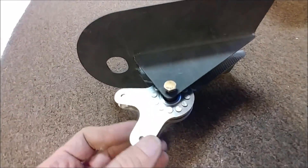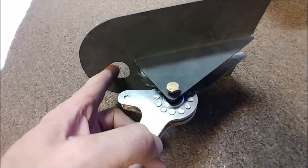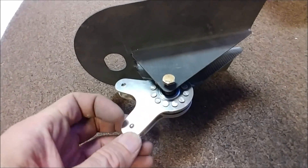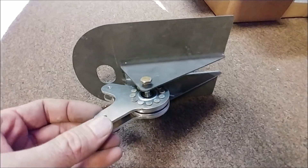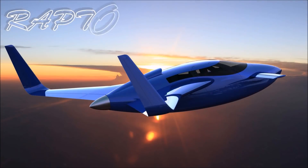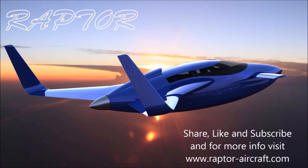Here's one of those bell cranks in its bracket, showing basically how it'll work. There'll be a rod connected here going through that hole and hooking up to the aileron, and another rod running down the spar to the other bell crank at the end of the main spar — that's how it actuates the aileron. Anyway, that's our update for this week. Tune in again on Tuesday to see where we get with pressurization and possibly beginning to get the wings ready to assemble. Thanks for watching!